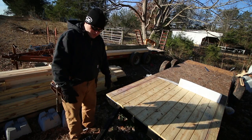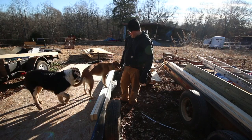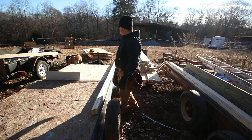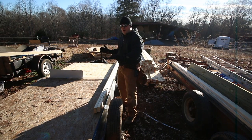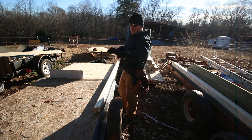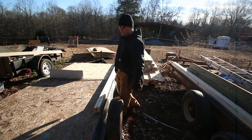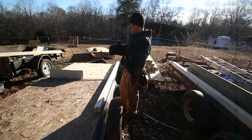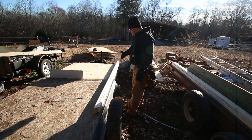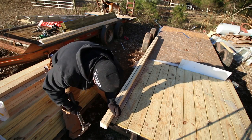Now that that's done, I'm going to start doing my plates. These two long walls are going to run from the outside all the way to the outside — basically the full length of the trailer. The inside walls are going to butt into these longer walls. These will be framed in one piece and stood up. I'm going to start out with two ten-footers right here, and then finish it with some of the studs that I have.